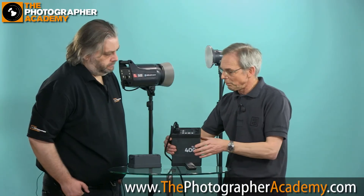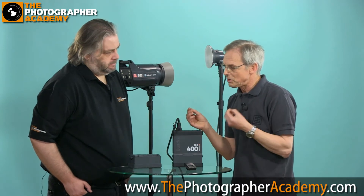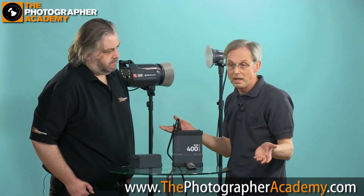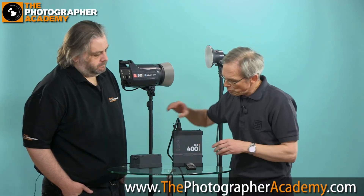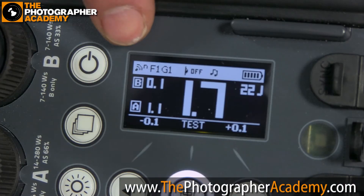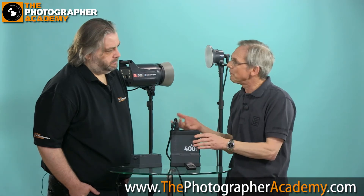The most important thing about this pack is battery management. When we moved from lead-gel to lithium-ion batteries, we had to manage every aspect of the battery to keep it safe and obtain certification for air transport. Within each lithium-ion battery there is a microprocessor board that monitors the total history. That's why there's a battery readout on the battery itself, which is more accurate than the pack's display — the battery's microprocessor gives real-time capacity, while the pack only measures voltage.